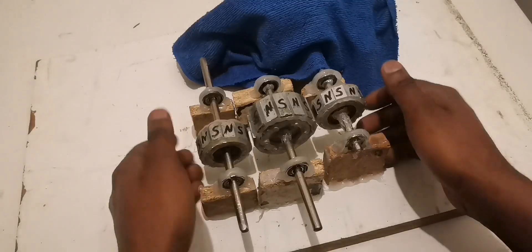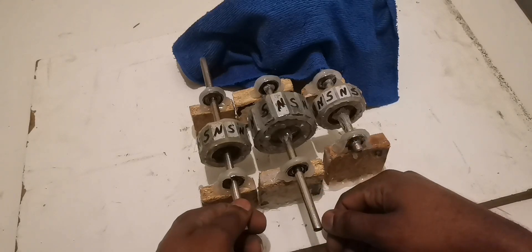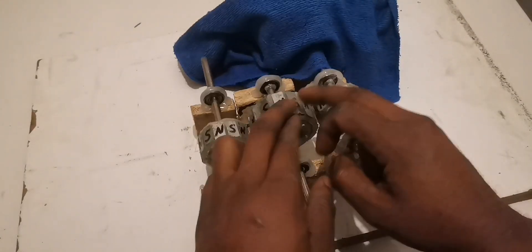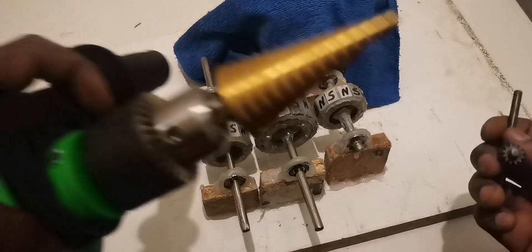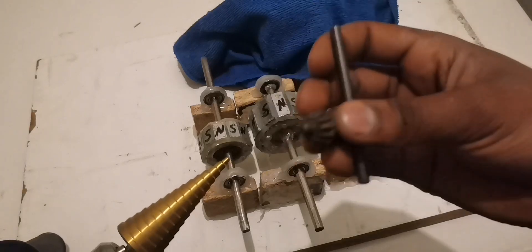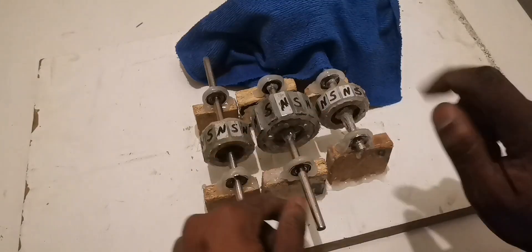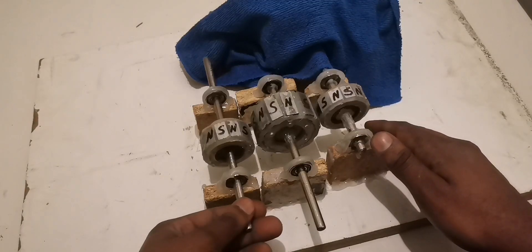Let's say 10 poles and 10 poles, and you need one to be bigger so that once you spin it once, the other must go twice, or maybe 15 times or 10 times. Then it doesn't matter how many magnets you put here — you don't have to match with these ones, same as with regular gears. This one can have 10 and this one can have maybe 30, which means once you spin this once, this one is going to spin maybe three or five times faster. Just make sure all of them are arranged N-S-N-S.